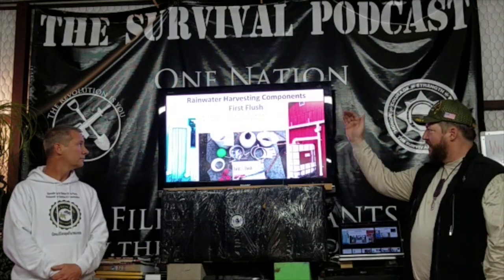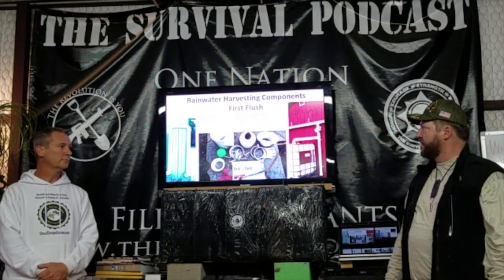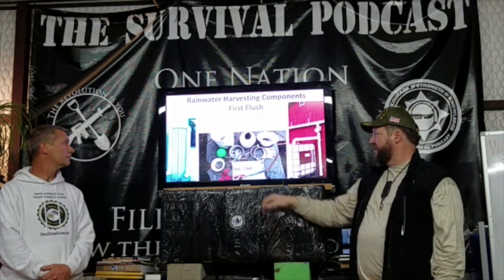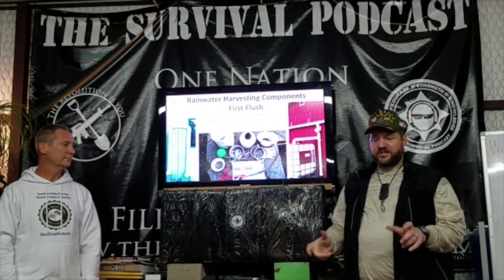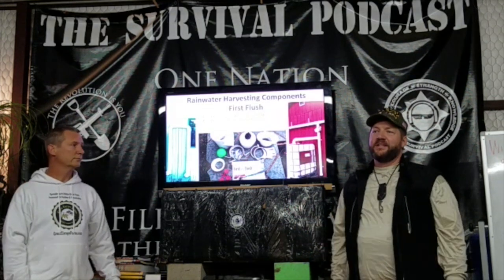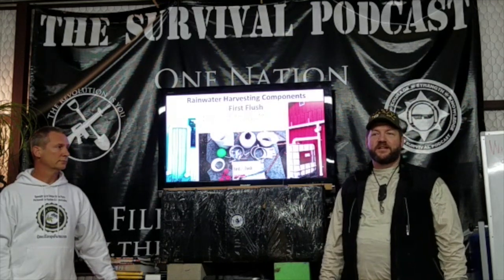So I had to tee it off. Otherwise I would have done just a straight drop and done it that way. So I'm getting 7.5 gallons in the two 4-inch pipes. I've got a clean out on the bottom. I found on YouTube a video showing a guy doing a similar system. Basically, you just open up the cleanouts enough that it just dribbles out the bottom, and then you can open it up once in a while and clean out the sludge that it eventually collects in there too.